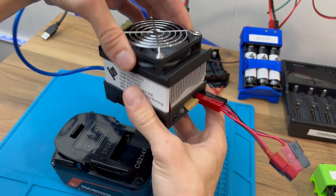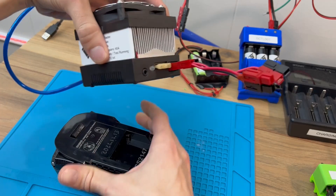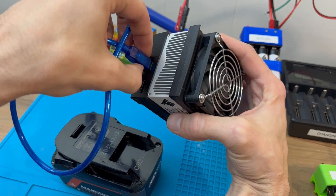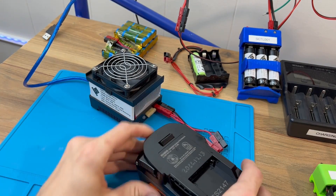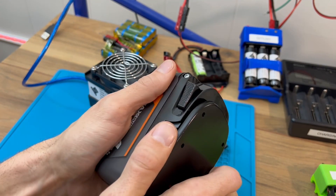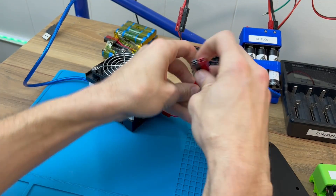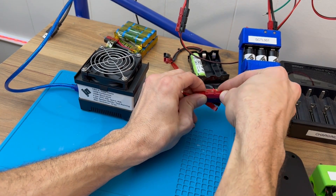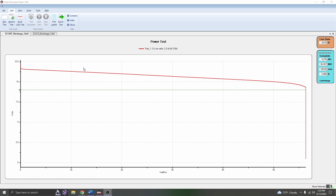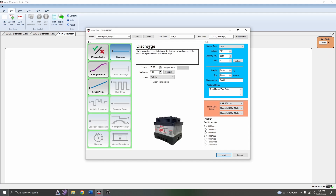Lastly, we have the computerized battery analyzer for very sophisticated measurements, but it has really simple software on the PC and it communicates over USB using just a USB printer cable to your computer. When you plug this one in, it's useful for grabbing a battery you selected for your project and measuring how long it will last and what voltage it carries throughout its life and consumption.